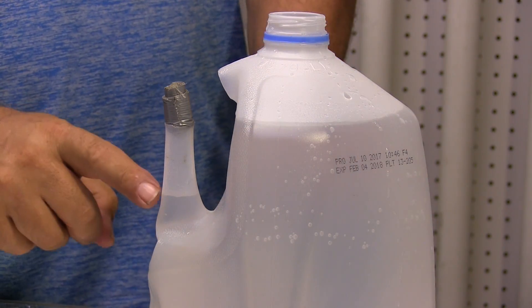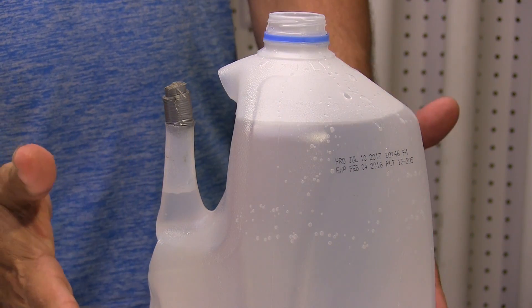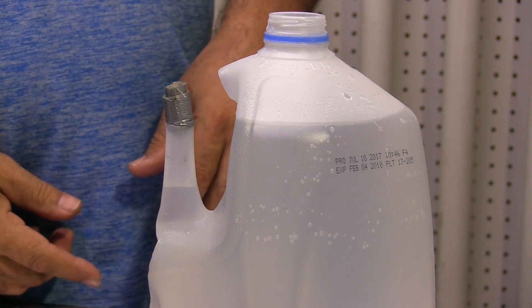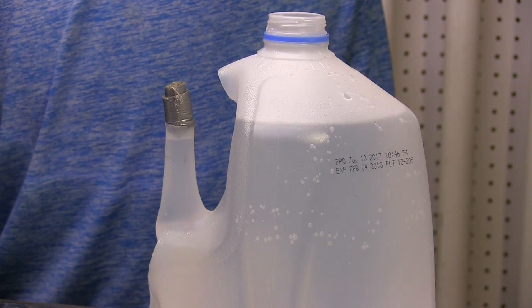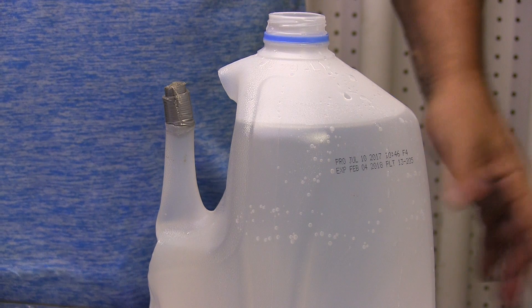If this were argon here, this would be air and oxygen right here. And unlike water, which is just kind of there, this little area would be swirling and mixing in a little oxygen with the argon and you wouldn't get a great purge. That's why you need a little vent hole at any high point that might trap air. That allows the argon, which is heavier than air, to fill it up just like water — then you can get a good purge.